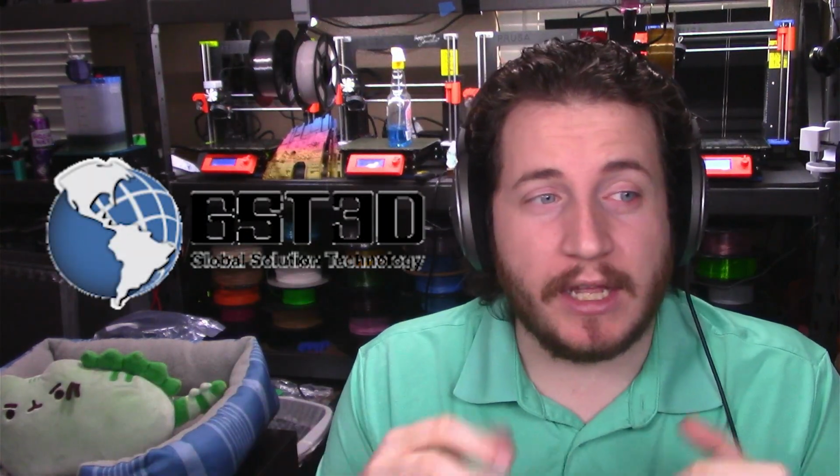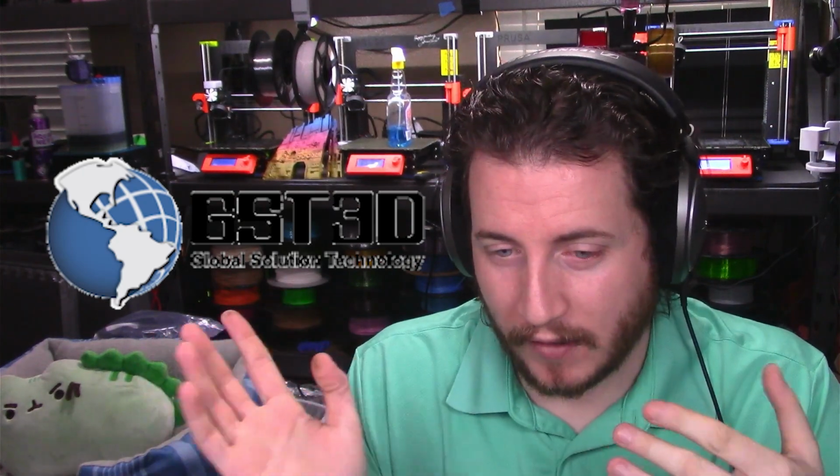I also had Jimmy go through and measure his filament. The GST3D that we have here is way out of round. It was for the client's Ender 3 Pro that we've been working on. We'll card to that series so you guys can take a look because there is another video coming out on that reasonably soon. But we were seeing all the way down to 1.64 and all the way up to 2.2, which is a massive movement of filament diameter and definitely not good. Jimmy was seeing 1.74 to 1.77. That is within margin, I will say.